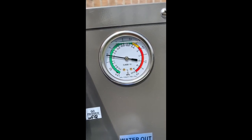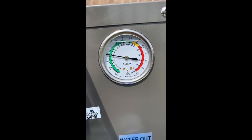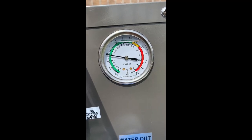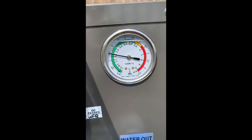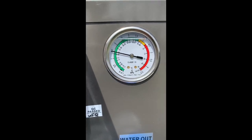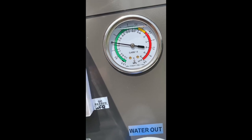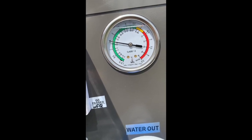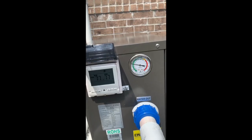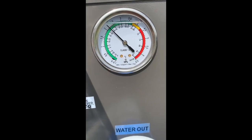In the FH55, there is a 4-minute delay in case of an error or malfunction — it resets itself for 4 minutes. So if the compressor doesn't come on right away, just take a break and give it 4 minutes; it will start back. The compressor should be up about now — it's all working.